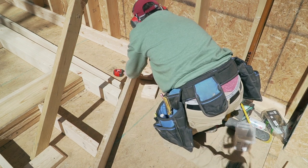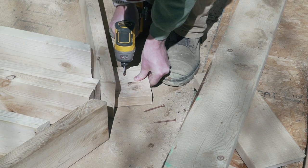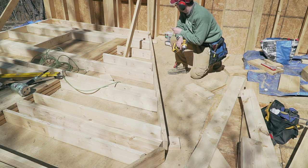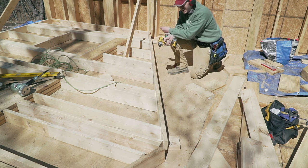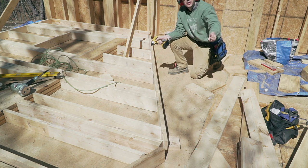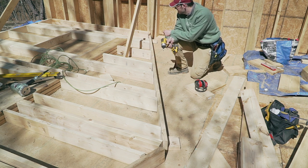So just like I did for my bottom plate, I'm going to add blocks here to make sure that this doesn't move. So this end is kind of set in stone. Before I go nuts with the nail gun, I'm using some screws to attach the plate to the studs and see how it looks, so that if it doesn't look good, I can easily remove it. Honestly, I don't know how you build a gable end wall. If there's any carpenter watching this with any tips to get this done in a much easier fashion, please let me know. This is insane.